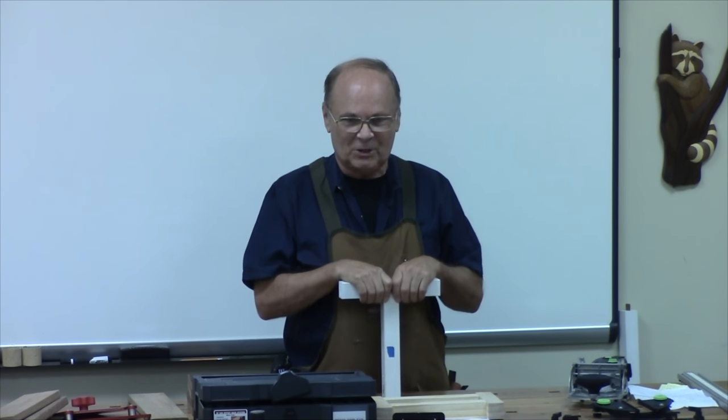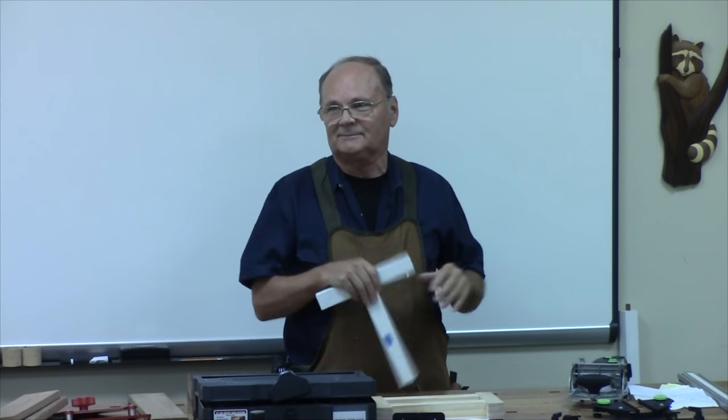She liked that job so well that she wanted to do more. Her house had been covered over with vinyl, and she and her husband had been extremely successful in business. They liked where the house was. She wanted a railing to replace the ones in front. They had done pressure-treated wood three times. One of the problems with pressure-treated wood — if you pressure-wash it, it doesn't matter how you put it together, that water is going to get into that joint. So it had rotted out on them three times in about ten years.